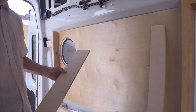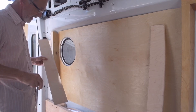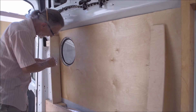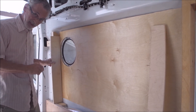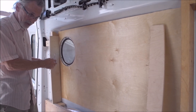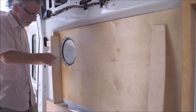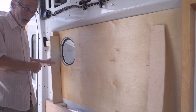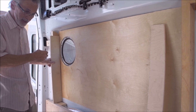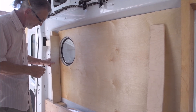All I need to do now is just cut this out, stick it up there, and trim off the back side a little bit, and then we're going to have that side plated. You could set this thing in there, but it's going to look awkward with just a scratch and a hole. I probably could bury that with a molding strip, which I'm going to use anyway, but I still like to get it closer — it's good practice for when I get to other areas where I'm going to have the same problem. Keeps me as accurate as possible.